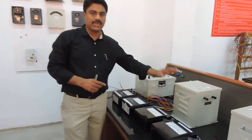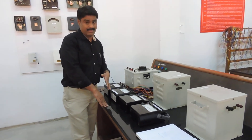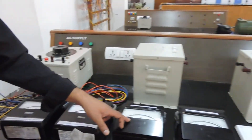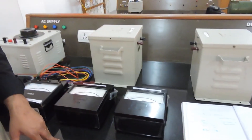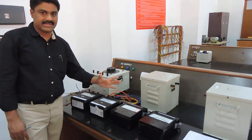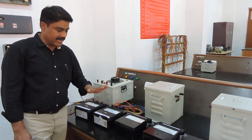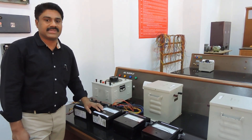The next important point is polarity. Because we are connecting two identical transformers in series on the secondary side, we must be very careful in checking the polarity — that is the third important point in making a Sumpner's connection. We also need wattmeters to measure power and ammeters to measure current. To summarize: the Sumpner's test measures the efficiency, the regulation, and the temperature withstanding of the transformer. Next, we will proceed to the connections and go step by step through the readings and calculations.